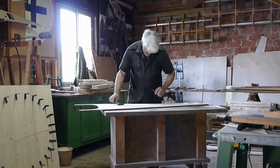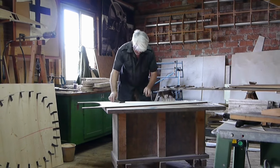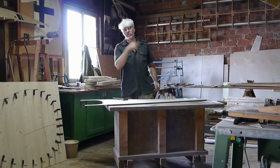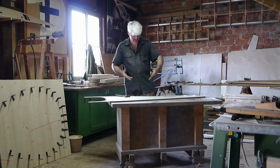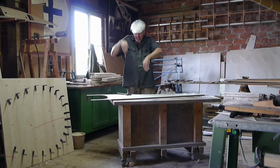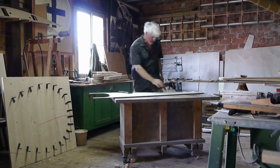The turtle decks get their stability from wooden strips that are glued on the inside and nailed through on the outside. As already mentioned in episode 10, wing spar making, nails should never be driven in vertically, but always at different angles, so that they interlock in the wood, which means that an outward pull cannot simply pull the nails out.